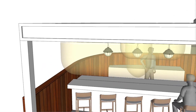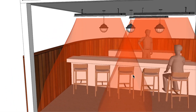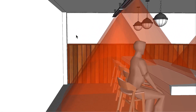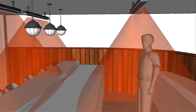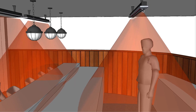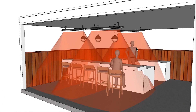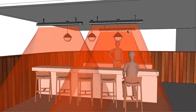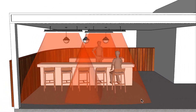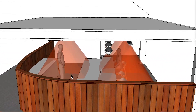Looking at the footprint of heat, with the three units we have really good coverage throughout the whole span — we're almost getting the full 7 feet. Standing underneath a 3,000 watt unit you're very close to the heater, which is why we recommend 3,000 watts above any higher output. A 4,000 watt unit would be awfully hot to stand underneath, and even a 3,000 watt unit might be too much for some people. This figure is about 6 feet 1 inch, so even sitting at bar stool height you're closer to the heater than you would be in casual seating. We're getting very good coverage and I think it's a really good application here.